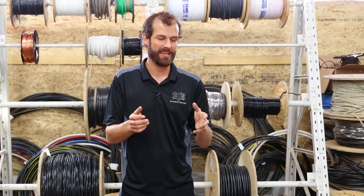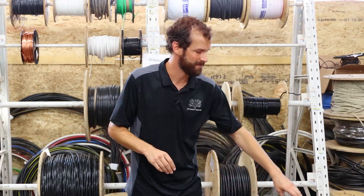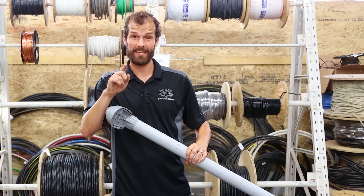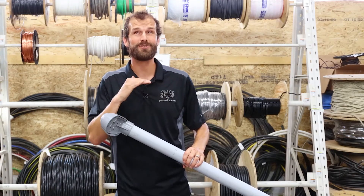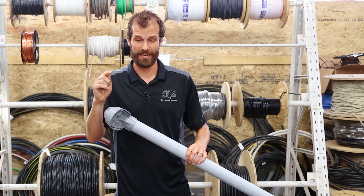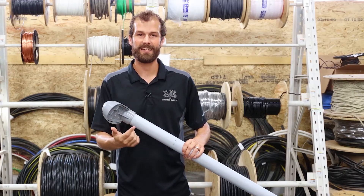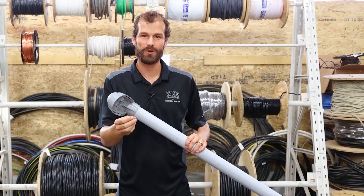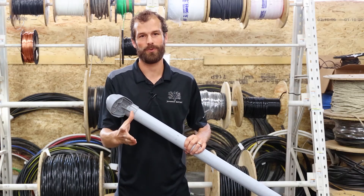I get right out there, I'm investigating, and within three minutes — kid you not, three minutes of being on the job site — I found the issue. It was actually the utility connection; it was not my fault. So relieved. The wires exiting the weather head were connected to the utility service drop and that neutral had pulled loose and separated.